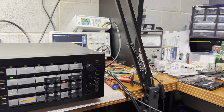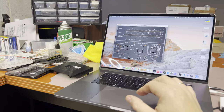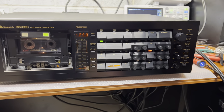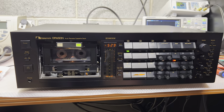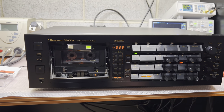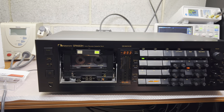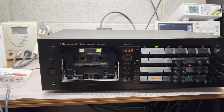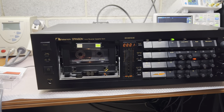I just recently checked it using a millivolt meter, and now I believe you'll be able to check it using this NAGT100 analyzer software. This tape was recorded on a Nakamichi DR2 and has been verified with I believe three DR2 and two DR1 Nakamichis. It's been within one decibel precision across all five decks, so I hope this will be really, really good. Let's start — the first frequency is 315 Hz, let me see the levels.